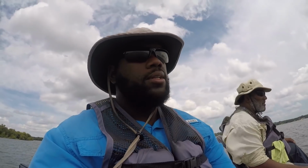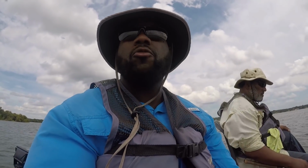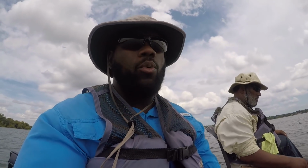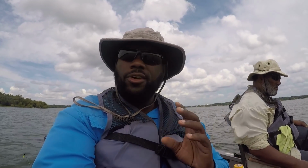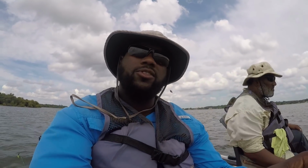The last thing I want you to remember through this entire video, if you're learning how to run a foot control trolling motor or a cable steer trolling motor, I want you to keep in your head momentum. How much momentum you gain is going to either keep you in place or it's going to throw you past where you want to be.